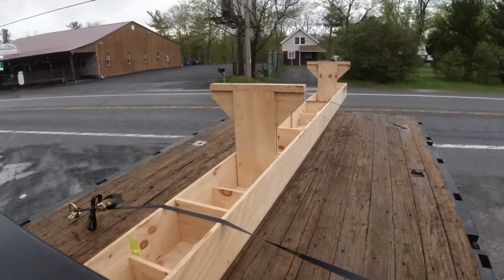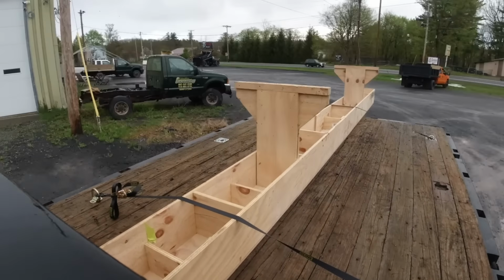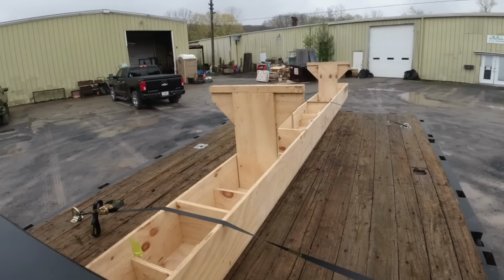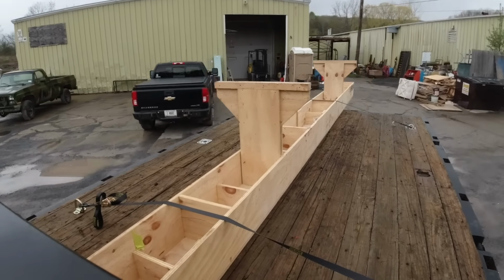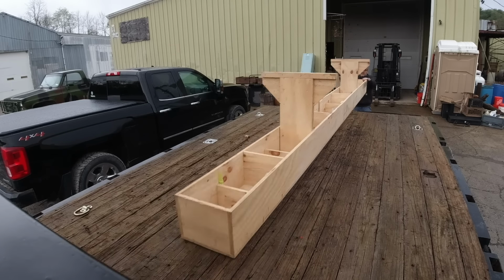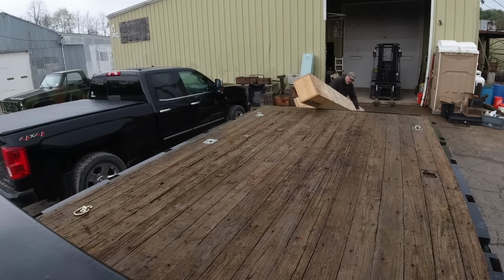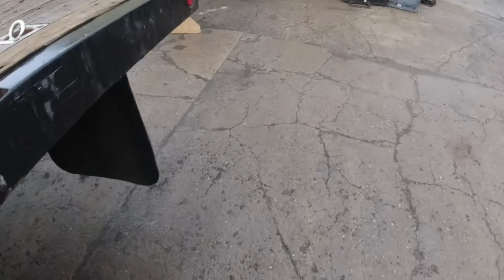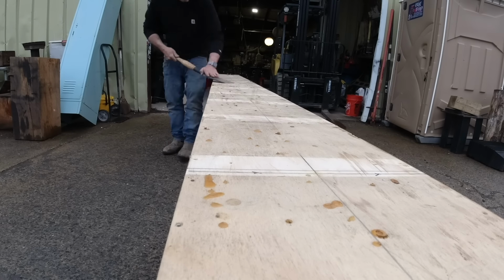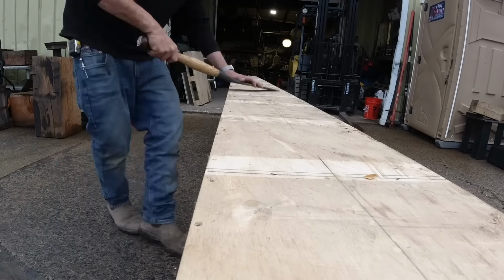The difference between the canoe and this Rice Lake Skiff, or this 13.5-foot rowboat, is this is going to have a flat back, and I was given the wood for the canoe, and the wood consisted of cedar strips with the cove and the bead, so that one piece could fit snugly into the other regardless of the angle of incidence.